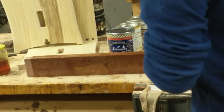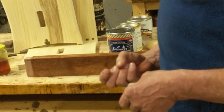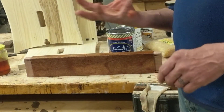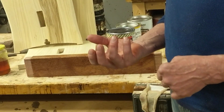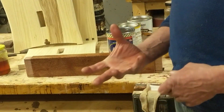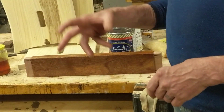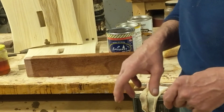I've got some Festool pads at 1,000 grit. I think I might have had 2,000 grit at one point. But I can take a really fine silicon carbide sandpaper, lubricate that finish with a little bit of water, and then wind up buffing, sort of putting scratch patterns in that very high gloss finish to bring that sheen down.